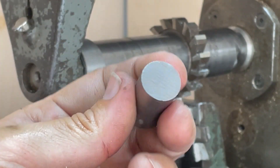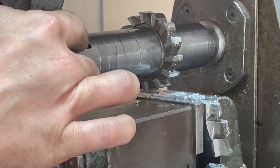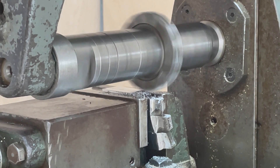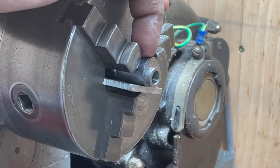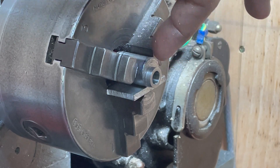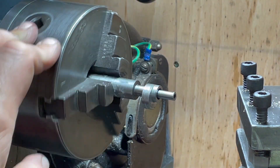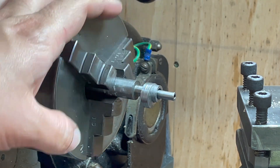Here's what I'm going to turn into the sheave, and here is me machining some aluminium to act as the offset — a perfect opportunity to try out the horizontal miller again. This is the packing material used to offset this piece of 5/8ths steel. I've turned a little boss here, then centre drilled it and drilled through sequentially up to 17/64ths, then bored it down to 9/32nds to fit the axle. I'm going to try and use my arbor to clean up this face — I'll let this set up and we'll see how we go.